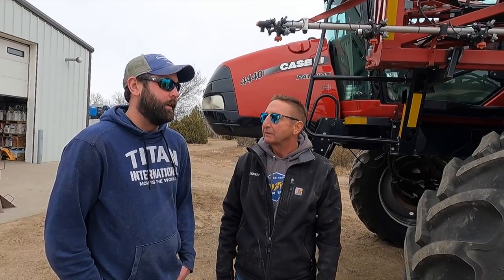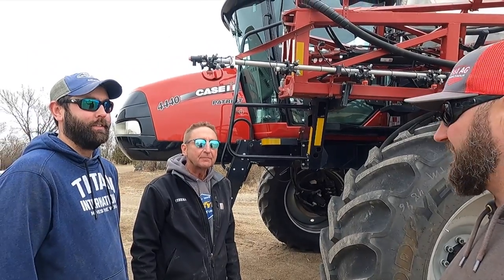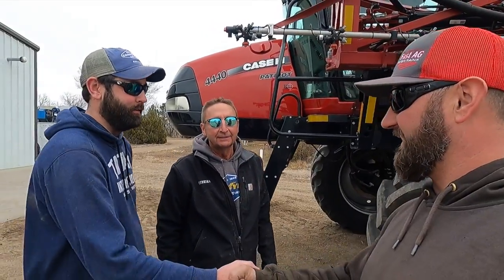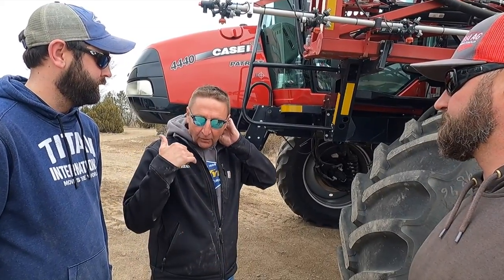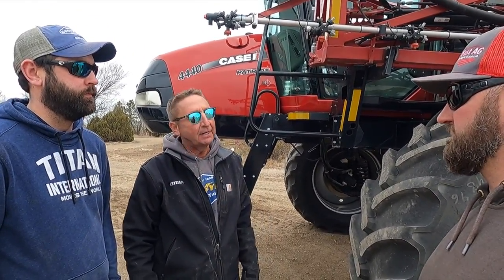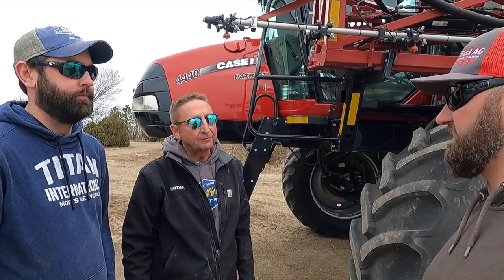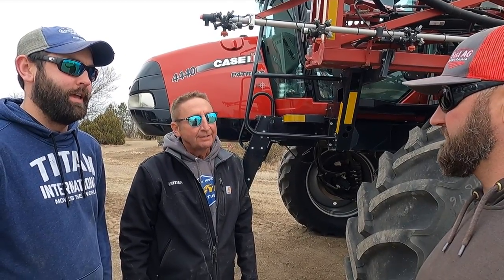This is a shallower, wider tread with a little bit larger nose, so when you're roading you've got more footprint and more lug on the ground. We've also got a more rounded shoulder than the standard Opti-Track tire — as stealthy in the field as you can possibly get. Michael weighed things up and we set the fronts at 17 PSI and the rear at 20 PSI. The sprayer came in at about 49,000 pounds — that was with 1,600 gallons of water. You're ready to go.